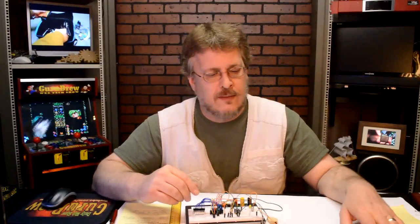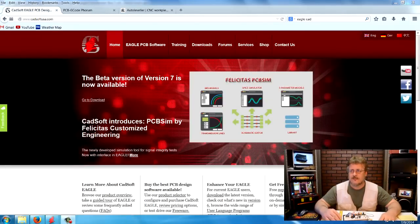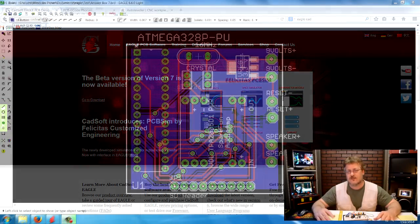So this problem has to be overcome and I think I have a solution to that. Now I'm going to show you some software that I've been playing with. Everything I've chosen for the software is freeware if you don't use it for commercial use — I wanted to do this for as low a price as possible. There are four pieces of software in total that we're going to be using. That includes Mach 3, which isn't free, but if you already have a machine, I'm sure you're already using Mach. The first program is the Eagle PCB software, and the free version allows you to do smaller boards, and I think it's more than you'll probably need. I've just begun using this software and in two weeks I've been able to make a board and get it to work.